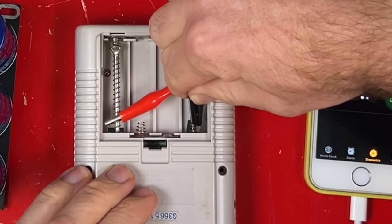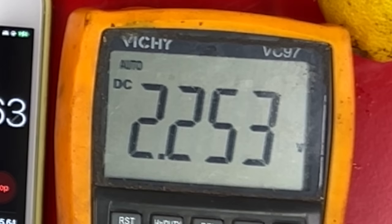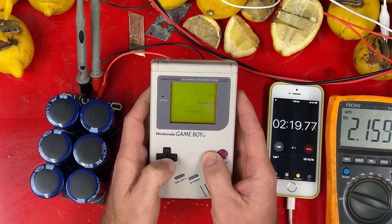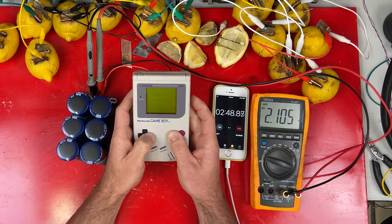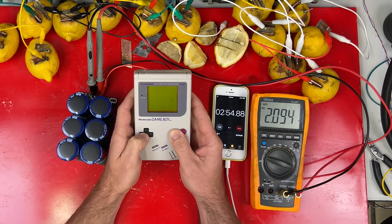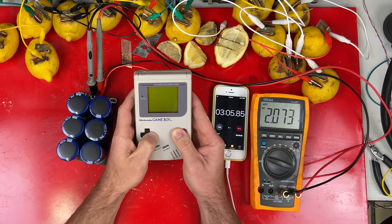Time to connect up the lemon power. Ready? Go! It's working! This music's going to be in my head for far longer than this power's going to last. Wow, the motion blur is so much worse than I remember from back in the day. When I was doing my research I managed to charge up half a volt into these capacitors with one lemon in two hours — I thought this would be easy, done in a day. But it turns out lemons don't seem to stack quite like batteries do. I expected the charge rate to stay the same and the voltage to come up. It just didn't work that way. I guess lemons have a more significant internal resistance than batteries. Who would have guessed that fruit would be a kind of rubbish battery?